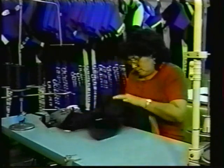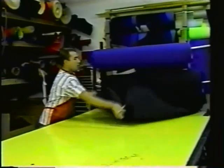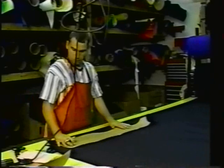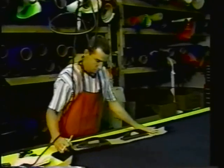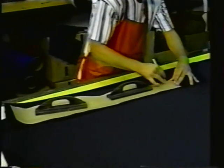All wetsuit neoprene is not the same in composition. Domestic neoprene from Rubatex is composed of nearly 100% neoprene and is formulated through an extrusion process, creating nitrogen cells to withstand the pressures of diving. Imported neoprenes are 30 to 60% neoprene, blended with plastic polymers, which does not have the added nitrogen cells to withstand the pressure of diving.